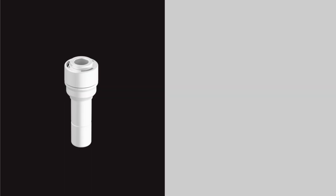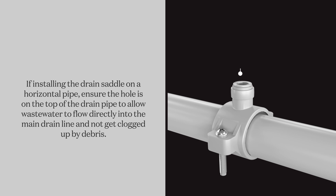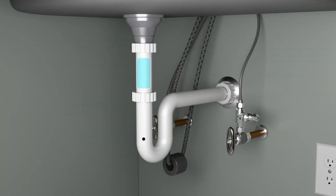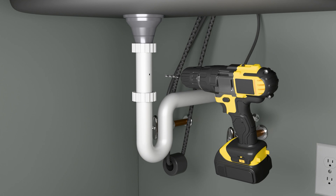Please note, a 3/8-inch to 1/4-inch step reducer has been included in your packaging if you plan to connect the 1/4-inch drain line directly to the 3/8-inch drain saddle. If installing the drain saddle on a horizontal pipe, ensure the hole is on top of the drain to allow wastewater to flow directly into the main drain line and not get clogged by debris. Use half of the drain saddle with the drain connection to test fit a location. Ensure the chosen spot is before the P-trap and is smooth and straight. Once satisfied with the location, mark the spot on the drain pipe for drilling a hole. It is recommended to first drill a 1/8-inch pilot hole to ensure the 3/8-inch drill bit remains centered on the curved surface of the drain pipe. Be extremely careful to drill only through one side of the drain pipe and not all the way through to the other side.